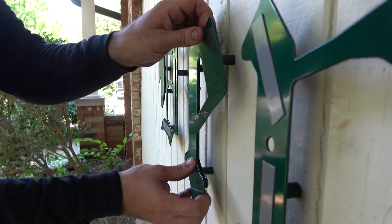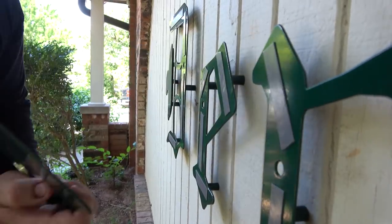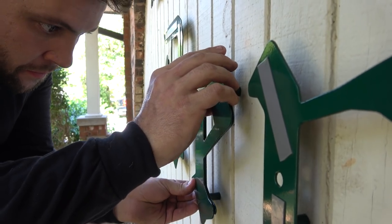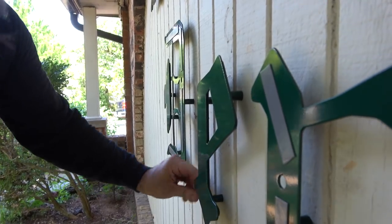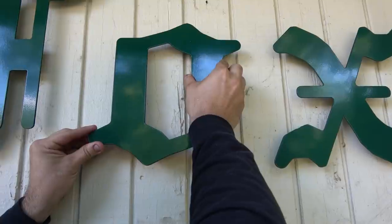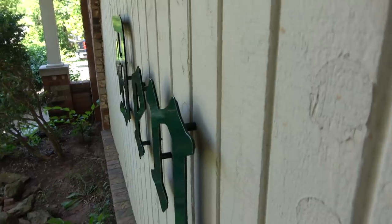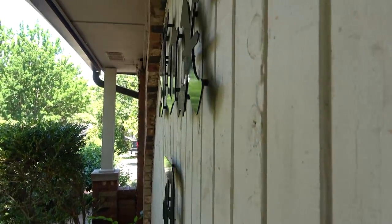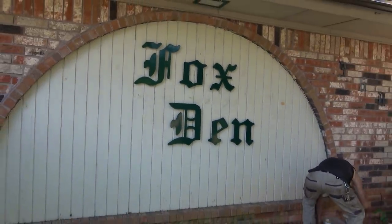With all of the pieces in place, you've got a little bit of play with VHB tape. You can real lightly stick the part on, and if it's not perfect, you can back it off and readjust it, but once you press it home, you're gonna have a hard time getting it off without messing the tape up and having to redo everything. Once that VHB has set for a couple days, it's locked in, and this stuff is a serious bond. Final check over all the parts just to make sure they look good, make sure I'm happy with them, nothing's loose, and we're ready to get the final approval from the customer.